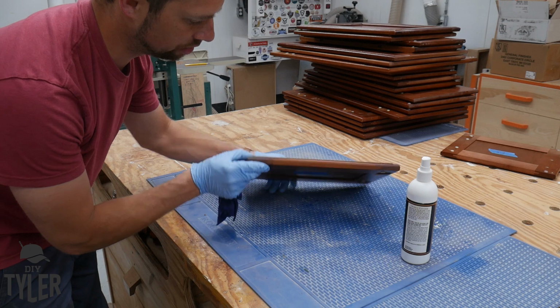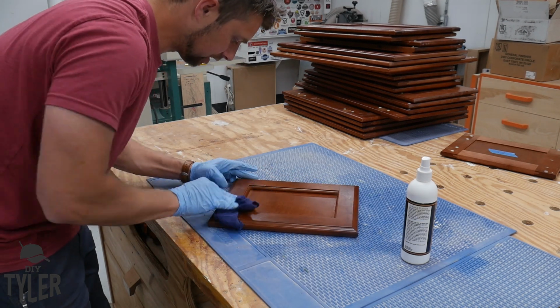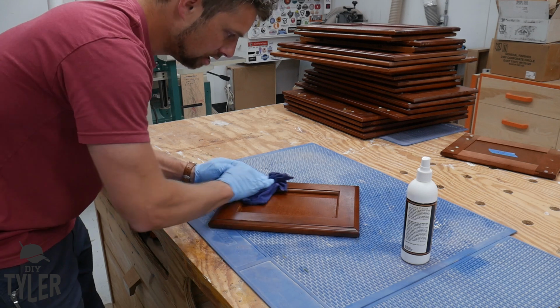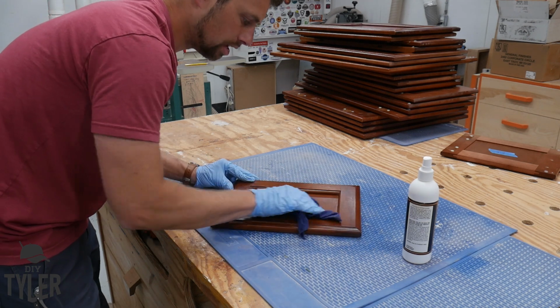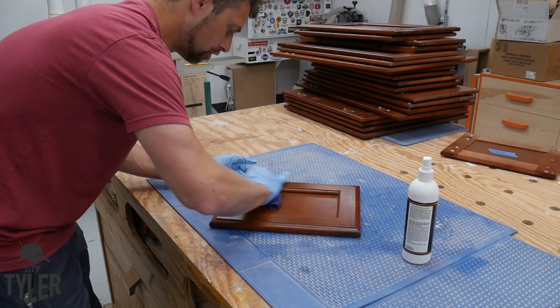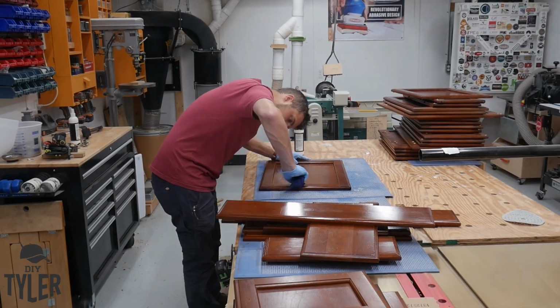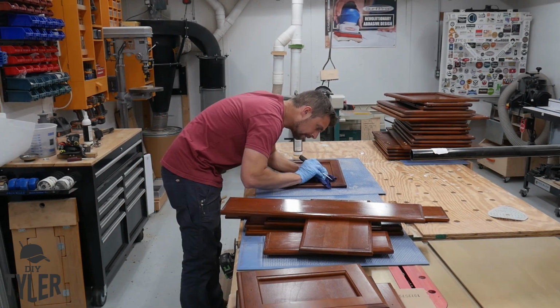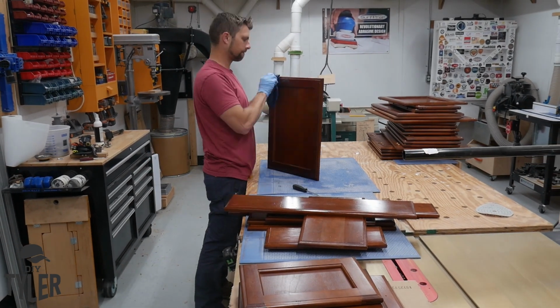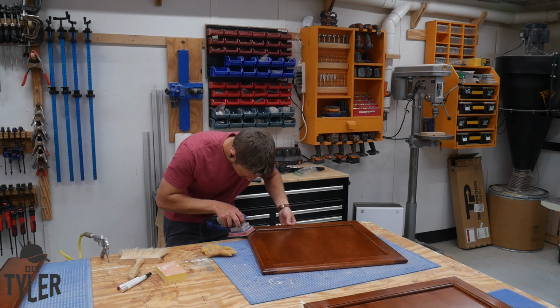Like right here, these are over the stove, so there's some distillation of food and steam and stuff like that. So get them all nice and clean so we can scratch them up and get a good bond surface for our new finish, and any toning or color if we've got to get it on there. This definitely did take plenty of time to make sure everything was clean, but don't overlook this. You don't want any grease spots to prevent good adhesion of your new expensive top coat.